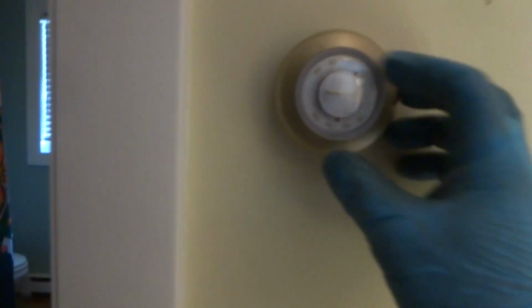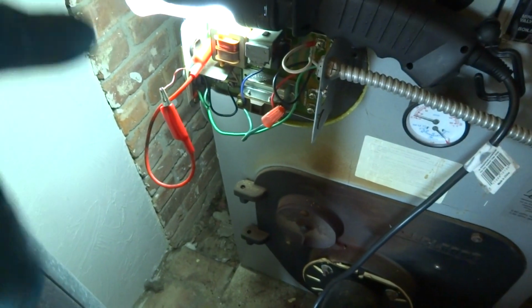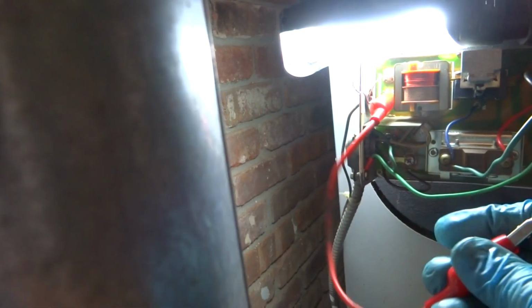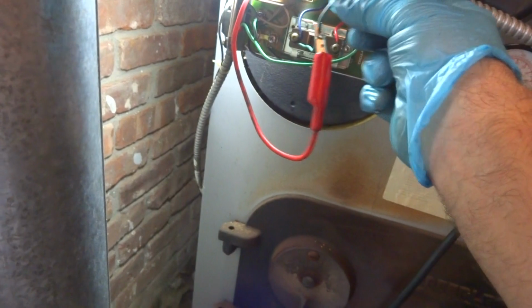I'm just gonna turn up a couple of these thermostats. All it needs is one for it to run anyway. Alright, okay, yeah, it's working now. Okay, great. They had this burner running continuously. Let me show you what was going on. I told you that the thermostats were tied together. Yep. What's happening is you got a relay downstairs, there's a 6-zone, and whenever that calls, it ties a TT in here to run the burner, and all the circulators are in the basement. But see this line here?